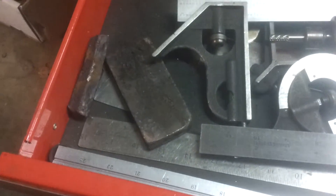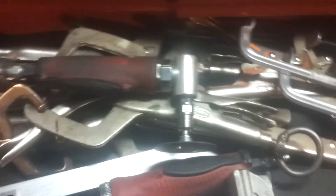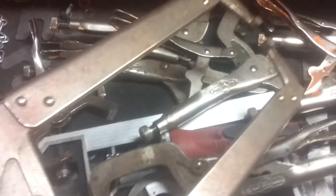Here's another welder's best friend. Copper - you know what copper is used for. More little copper pieces - for filling holes. You drill a hole wrong or punch a hole wrong, you can back it up with copper, fill the hole, grind it back down, and you don't have to scrap the whole piece. That looks like a little bronze punch. Those long finger clamps are okay for certain things like sheet metal, but they don't clamp that tight - they kind of just bend over. 24-inch square is hanging on the side there.